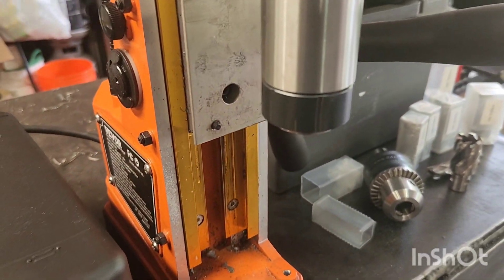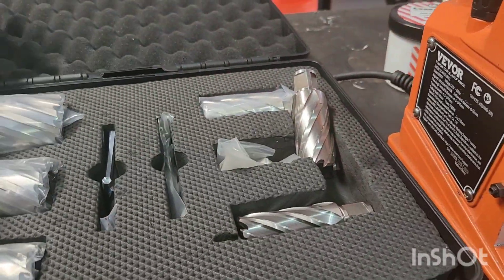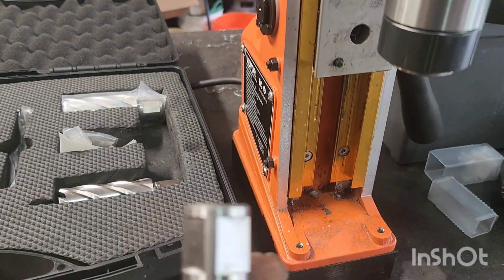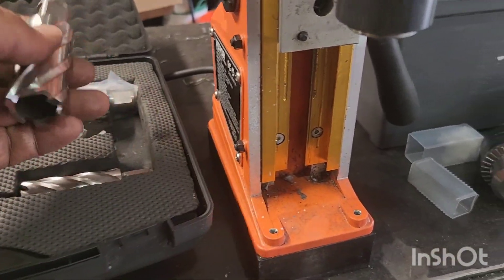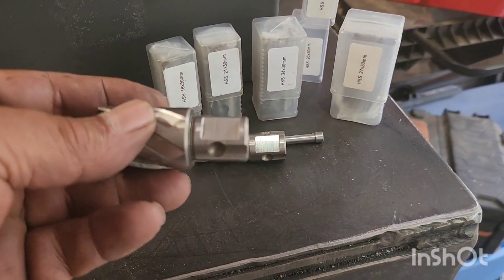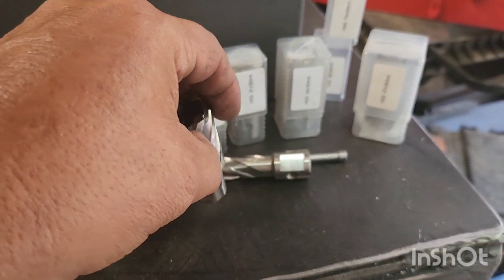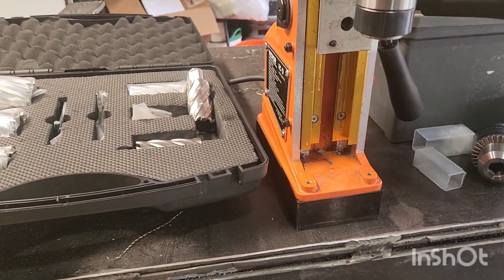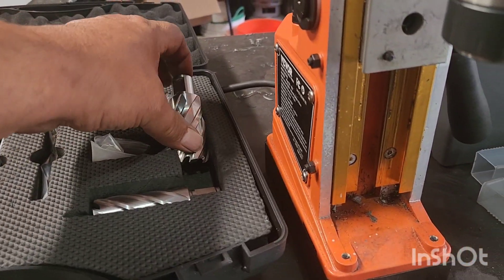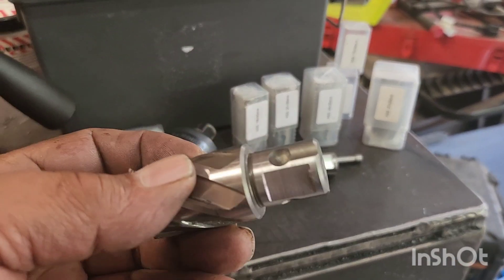On Amazon you can buy bits from the same company, but they do not work at all in this quick attach. They don't have the slots — they have two flat sides, all of them are like that. The ones that came with it are different: one side has a slot and three bearings so the bearings can sit in. It's not bad if they gave you the right purchase option on Amazon, but I haven't found anywhere I can buy the correct ones.